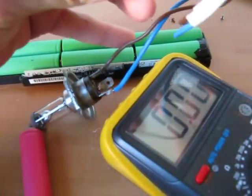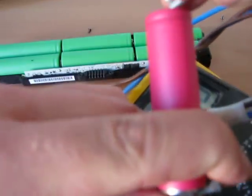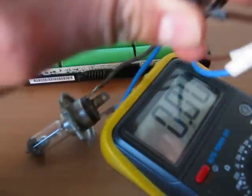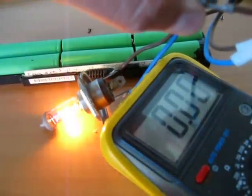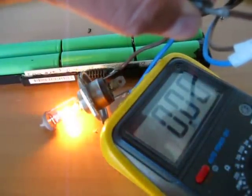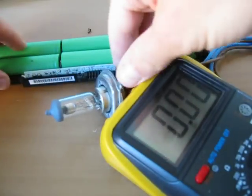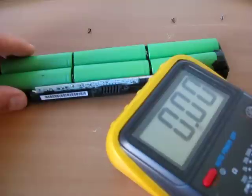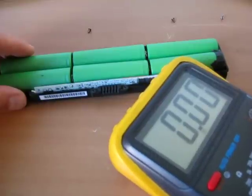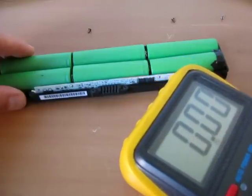It's a more reliable way to use a light. I'm connecting the light to the cell and it doesn't light up. And this is a healthy cell. Usually this battery pack has six cells, and usually only a few of them die. But it influences the whole battery pack performance.